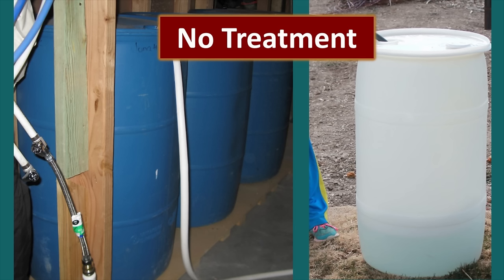There are disadvantages of treating it with chlorine up front. Yes, that is right. If you have water that may have some organics in it, the chlorine residual does interact with the organics and creates what they call disinfection byproducts. And this is a big deal in the municipal water industry. Those are highly regulated because they are carcinogens and do cause other problems. So this is maybe one advantage of doing the no treatment method and then treating on the back end.